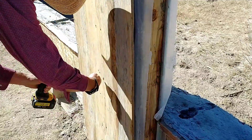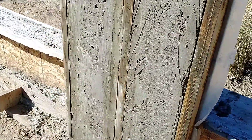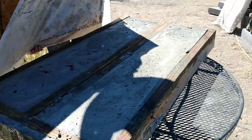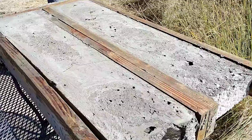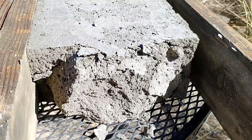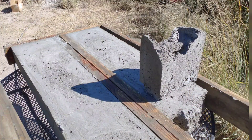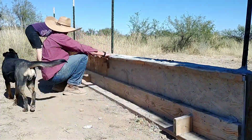We started by taking the form off our height test sample — really curious to see how it turned out. It actually didn't shrink very much, only falling maybe one or two inches on both sides, and some of that may have been due to the leaking. I'd consider anything less than 10% a success — on a 45-inch pour, 10% would be 4.5 inches — and it only fell about an inch to an inch and a half. Amazingly successful on both sides. When we took the back of the form off, we could see air pockets that had formed due to leakage settling. Unfortunately, both samples were invalidated due to the leakage.